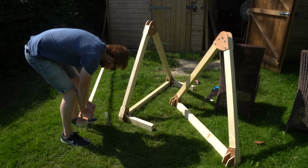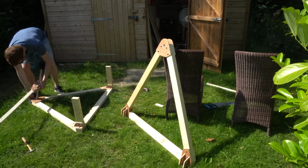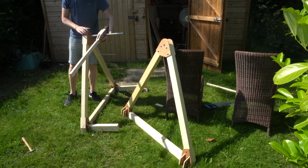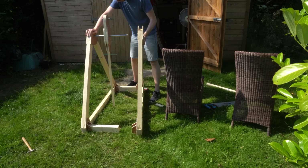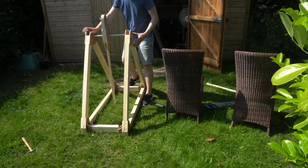The bearings were a tight fit on the axle and only slid on if the bearings were perfectly aligned, which is a good thing because having any play in the bearing or shaft connection could result in the arm or counterweight rocking side to side and possibly hitting the frame. The only downside to this is that the frame must be disassembled to get the arm in or out because the bearings wouldn't slide easily along the main shaft.